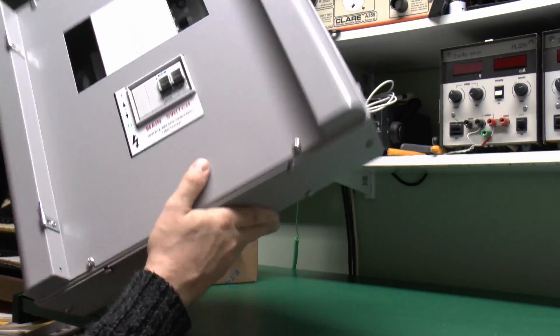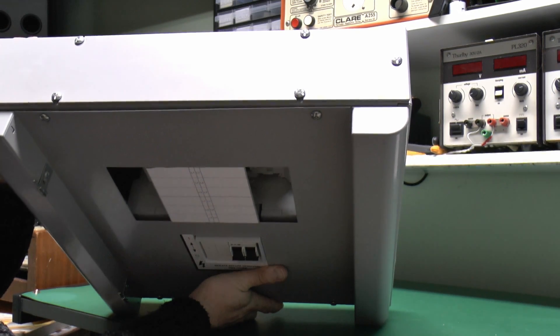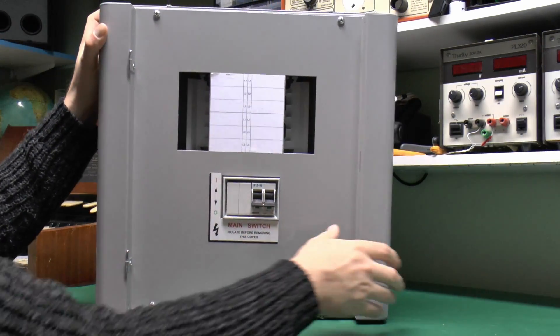The top of this one is exactly the same — you've got that removable plate there on the top, so again just cut whatever holes in it as appropriate. So there we have it — a three-phase distribution board. This one is going to be used on a single-phase application, mainly for it being much higher quality and considerably more robust than a typical consumer unit.